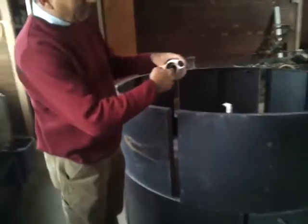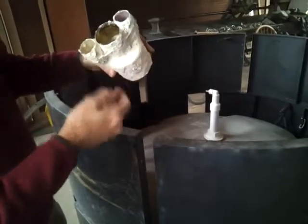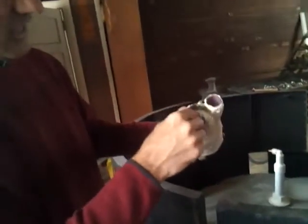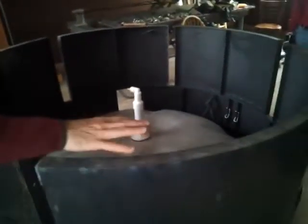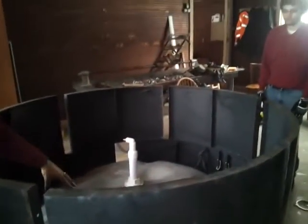This metal can here is the mold around which you pour the cement for the neck of the digester, and then the gas holder goes inside there and it collects the gas and the water displaces. So the way that it works in real life: the gas holder is submerged underwater and the cement poured around these molds forms that neck. The gas holder made of fiberglass is anchored — you can see how it's anchored.